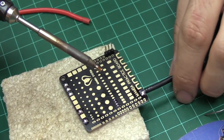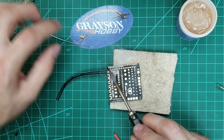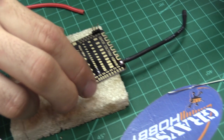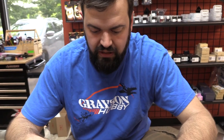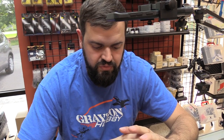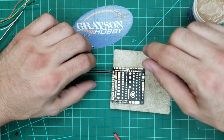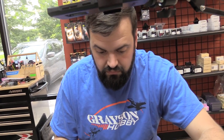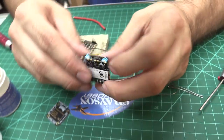That's pretty much all there is to it. You can add more solder and keep flowing, but remember if you get too hot it's going to fall off. A common issue is having to change out a connector — just heat it up and pull it off. If you have an ESC, the power leads and all the motor wires typically share a common ground, so you're going to need a lot of heat to pull the wire off. These individual pads here are going to be pretty easy to solder since they're not connected to anything else.